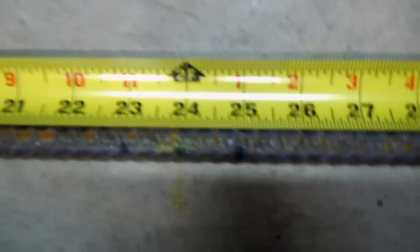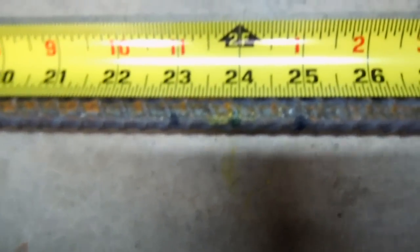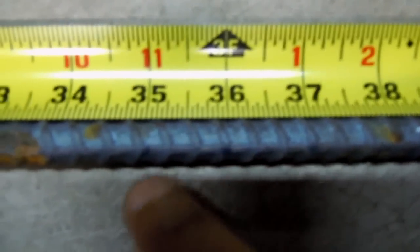I have a measuring tape set up at 5 feet right next to where we want to start. We want to count it off to foot number 2, and mark exactly at 2 feet, then 1 inch above and below it. The reason for that is we want to heat up right at the exact 2-foot mark and make the bend there. The beauty with this little torch is that the tip allows you to heat up in a small spot and it will bend exactly there — like a perfect 90-degree bend, exactly where we wanted it. The next mark you'll make from 2 feet would be at the other end — count from 5 to 3 for the other 2-foot mark and make your marks there. So between 3 feet and 4 feet, that's where your target's going to hang from and swing.